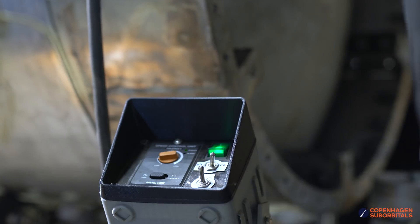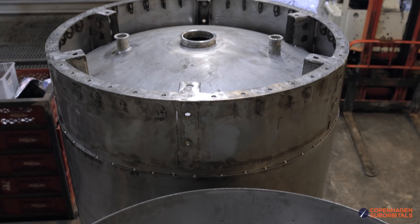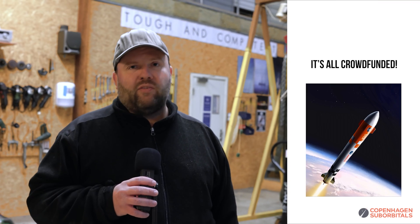This is one of the other things we are working on frantically right now. It turned out that the large diameter pipe cutter, which we've also been using for welding the tanks so far, was intentionally designed as a pipe cutter. Along the way our tanks took on more and more weight — initially a round tube, then an end cap, then a lot of slosh plates, then another end cap — and these tanks are approximately 175 kilograms when done. Eventually we could see our large diameter pipe cutter was actually starting to buckle a bit under the pressure, to such an extent that we couldn't really risk going ahead with the final welding on the tank using that setup. So we had to take a step back and make a quick decision on how to fix this situation, on a more permanent scale.